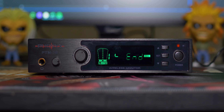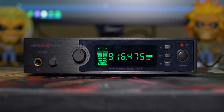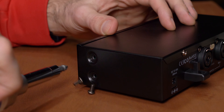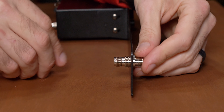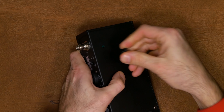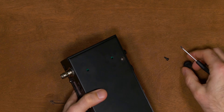One thing I don't like about the transmitter is that if you use a power strip to cycle the power, it will not turn back on until you hit the power button. I'd prefer it to turn on automatically once it receives power — not a huge deal, but if it's mounted in a rack it would be nice. Speaking of mounting in a rack, the rack mount hardware is really easy to install. Remove the two screws on either side of the unit, install a wing on either side using the same screws, then install the antenna panel adapter, antenna, and extension cable. Depending on where you mount it, you might want to remove the feet on the bottom — you can use brute force or take a small screwdriver, pry it up, pull out the middle pin, and then pull out the foot. What's nice about the rack kit is you can install it on either side. Overall, using the transmitter and receiver is straightforward with not a whole lot to complain about.